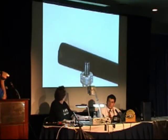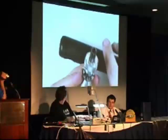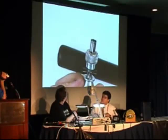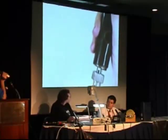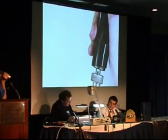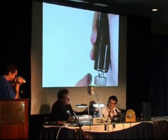I now reset the tool, so all the feelers are in the deepest position. Okay, they're all in the highest position. Now, when I insert it into the lock, the pins are actually going to push the feelers back. And when they are at the right position, they're not binding anymore, and they're not pushing the tool back anymore. And that's how it works.